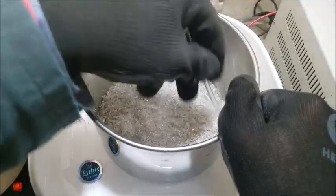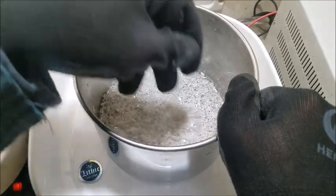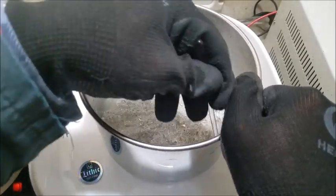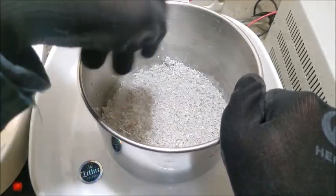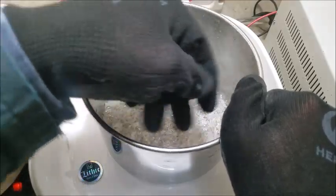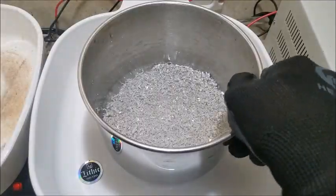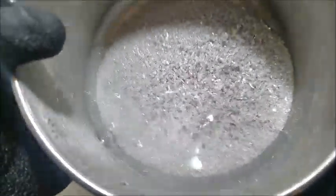I really want to work and break whatever little clusters that are not whole apart. Those pieces that are touching and bonded, they collect that electrolyte in the little nooks and crannies. So if it isn't one solid piece, I just want to break it apart. Make sure that our fresh rinse water is getting in there. That make you dizzy? Sorry.